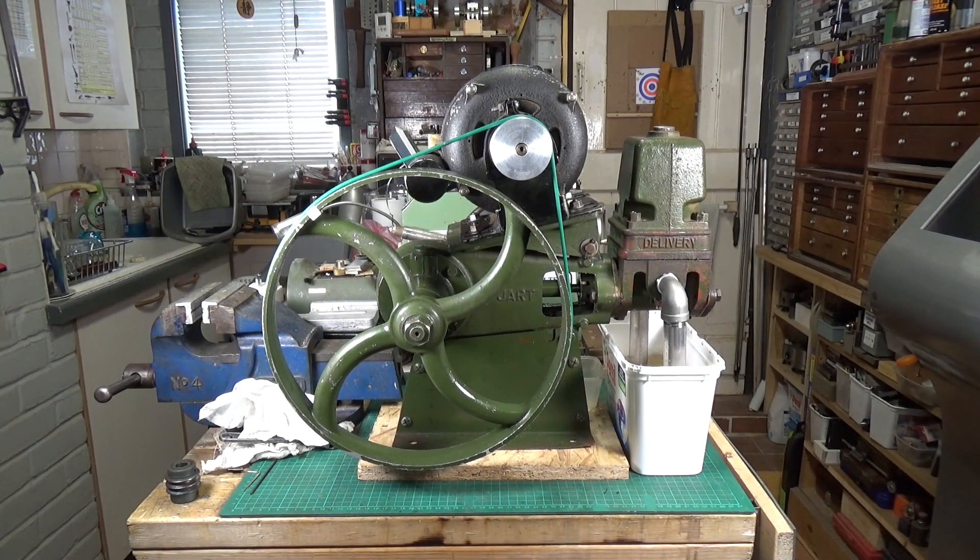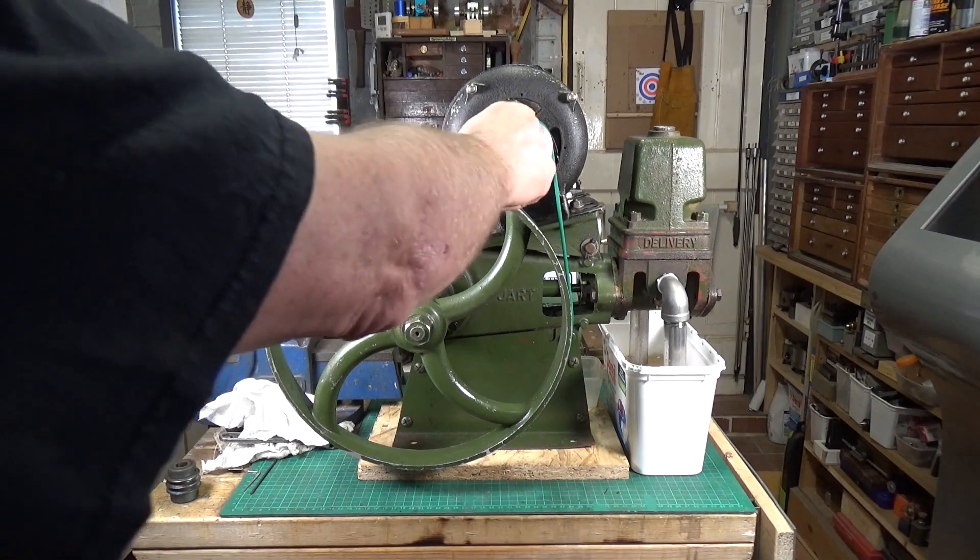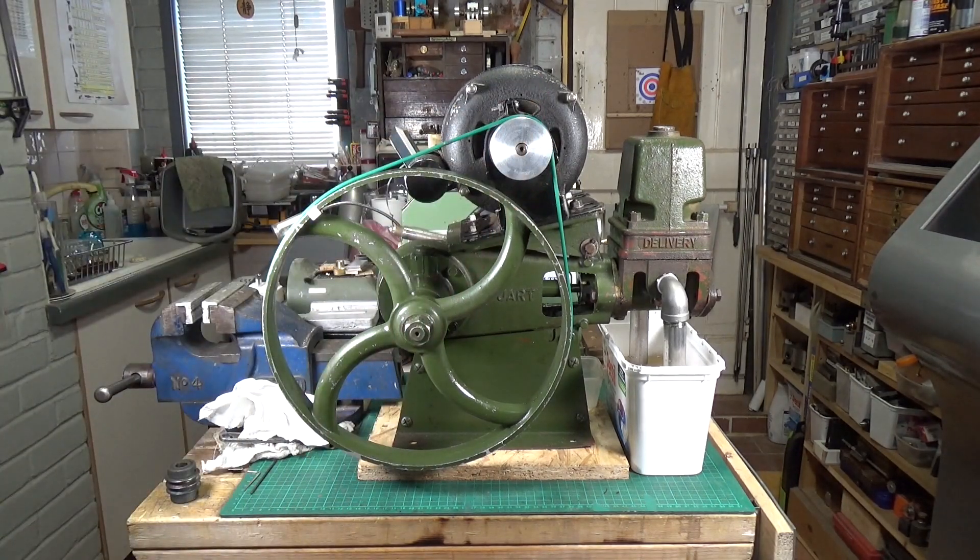The digital meter is showing 260 on average, so it's a little bit fast — I could probably do with turning this pulley down a little bit. But we're now much closer; we're only 20 RPM off what it should be, and I'm sure the extra 20 RPM is not going to damage it.